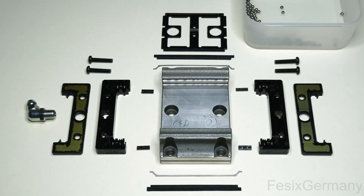Here is an overview of all the parts: centerpiece made from precision ground steel, one of the plastic cages that hold the balls in place, rubber seals against dirt, metal cages for a second row of balls, little plastic inserts for guiding the balls around the corner, plastic end pieces, rubber wipers and seals, grease nipple, mounting screws, and of course the balls themselves.